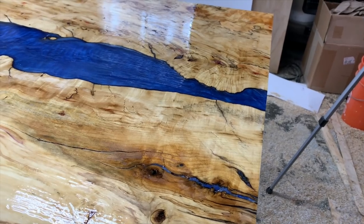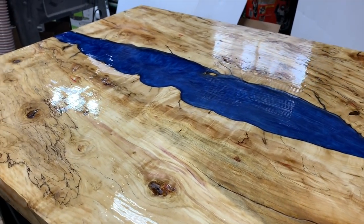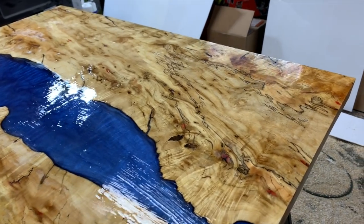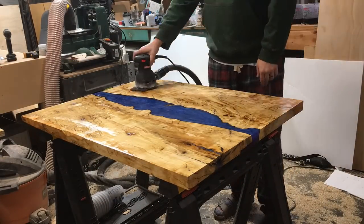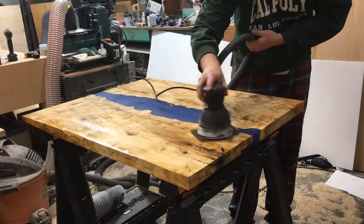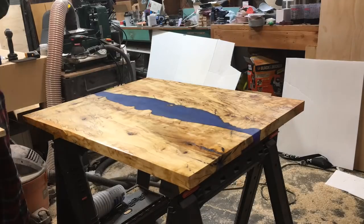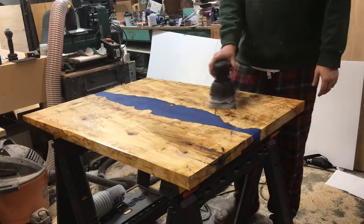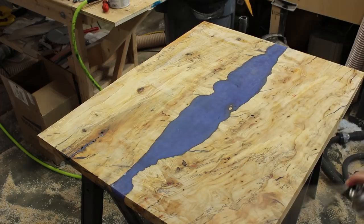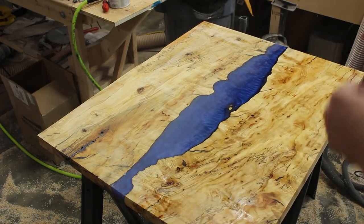It was 100% user error — even though I was using a foam brush I kept getting brush strokes. I did four or five coats thinking I could sand them out once completely done, flatten out all the brush strokes and imperfections, and if it was thick enough I could polish it to a really high sheen. But I ended up breaking through in quite a few places, so I figured I might as well just refinish it with something else — the same type of finish but in spray can form.